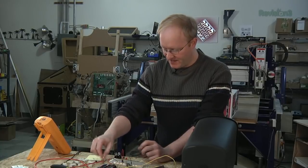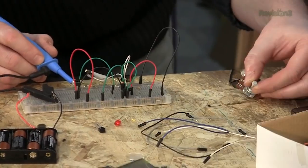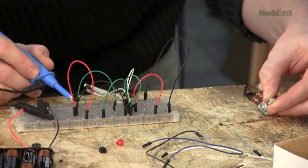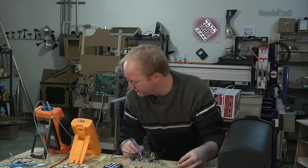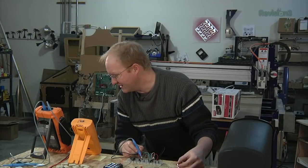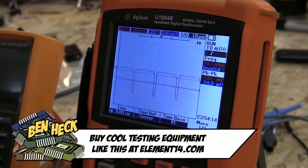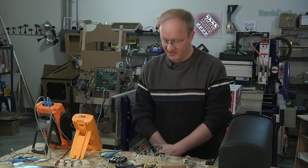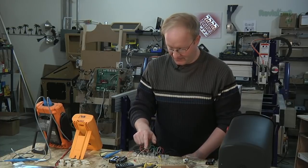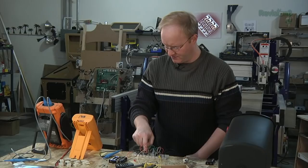What we really should do is make our infrared emitter pulse at the right frequency so this detects it for sure, which is 38 kilohertz. Using a 555 timer, I'm now creating a 38 kilohertz square wave which will drive our IR emitter. I'm going to use this potentiometer and the Agilent oscilloscope to dial it in and make sure I have the right frequency — need to get as close to 38 kilohertz as we can. Here is our completed test circuit with the infrared emitter and detector. We should see a change when I interrupt the beam with my finger.